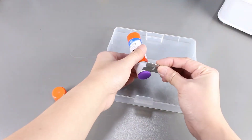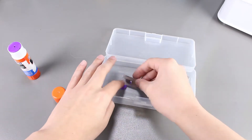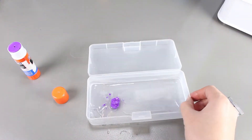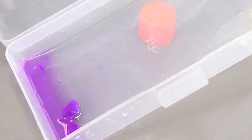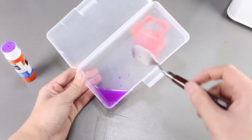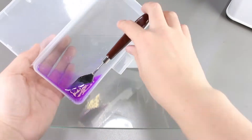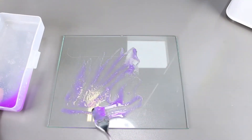I'll use a razor to cut off a portion of the glue stick. Now let's grab some hot water and then start mixing it. I'll try my best to make it consistent with the print removal knife. This consistency looks good. We'll apply it to the bed now, as evenly as possible, and then I'll let it dry for a bit — roughly 5 to 10 minutes.